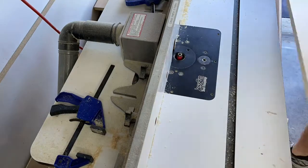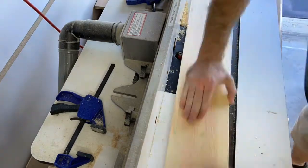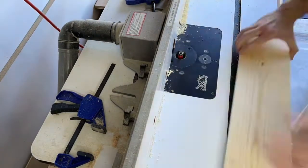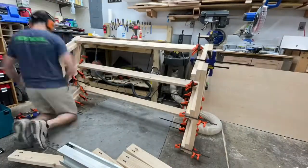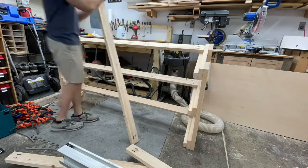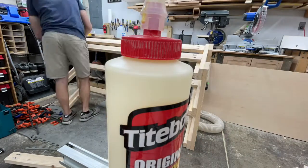Here's the face frame - what's going to act as the face of the weight rack. I'm doing a 1/8th round-over on everything. It'll save me some time from sanding and give it a smooth edge so it's not going to chip out. This will eventually be painted at the end, so it won't be too important that blemishes get sanded out. Once that extra support is put in, I'm putting in the rest of the 2x4 crossbeam supports - glue right in front of the camera. Sometimes I just forget I'm recording.